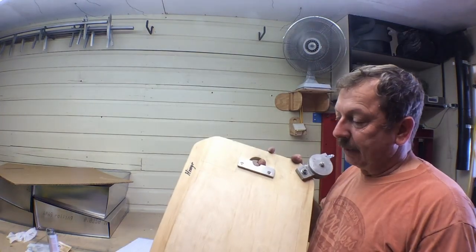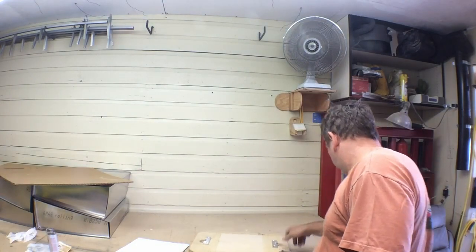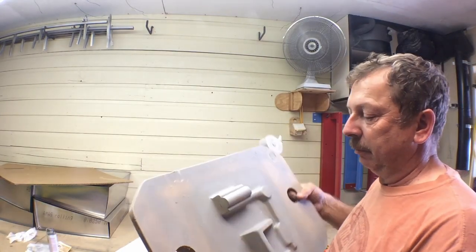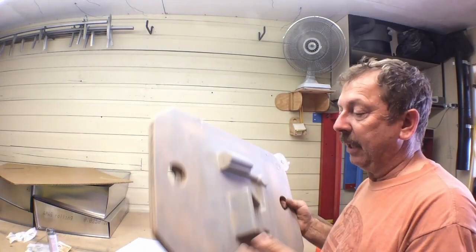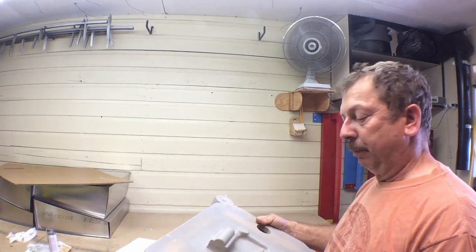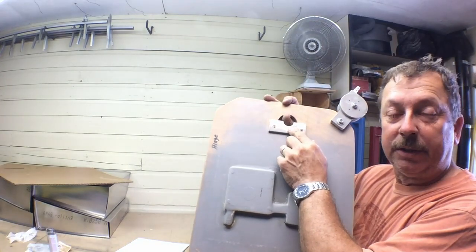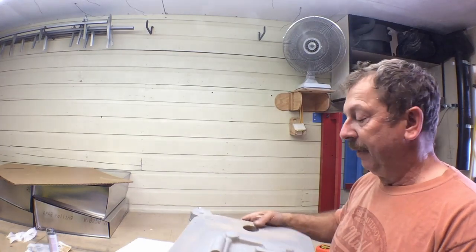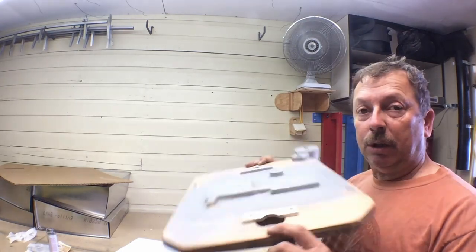Now, this particular flask is the one that I use the most. And I've got it set up for several of my patterns that I do a lot. This particular pattern is flask hardware. These are to build the hardware that goes on the end of my snap flasks. This one's getting in a little bit of disrepair, but the way it works is you put it on your snap flask, and these are basically adjustable. They're set up to give you the amount of tension and index it properly on the flask itself. You put that in place, ram up the bottom side, roll it all over as an assembly.